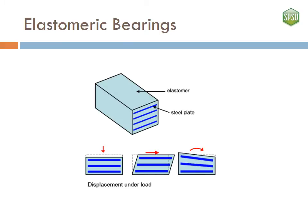Instead of using traditional hinges, the Bell 407 uses elastomeric bearings. An elastomeric bearing is simply a layering of thin metal shims that are coated in elastic polymers similar to rubber. These bearings act like hinges when forces are applied to them by allowing the rubber coating to deform around the metal shims. Bell uses these because they are cheaper and easier to maintain than a traditional hinge.